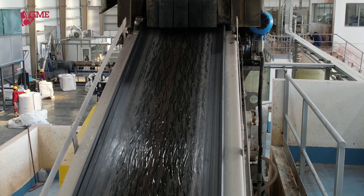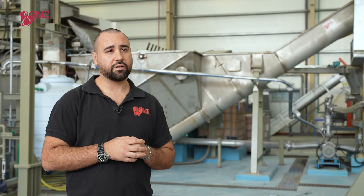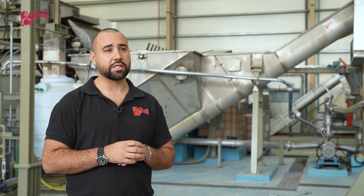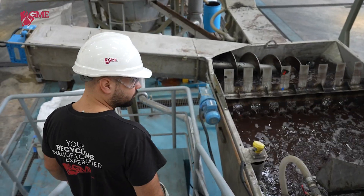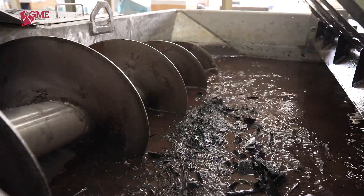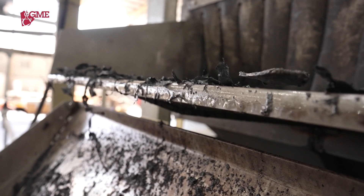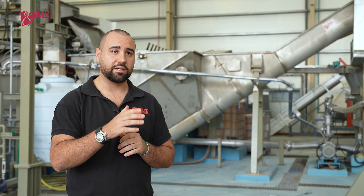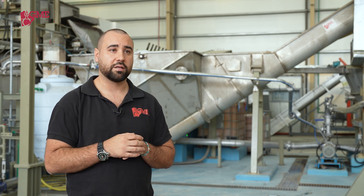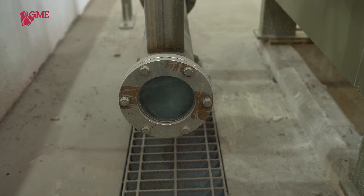The T-shaped hammer also achieves twice the lifespan of the previous one. Another very important feature is the vibrating hydro screen — composed of a screen washed by high-pressure jets — that guarantees the separation of lead paste, which is collected in a tank, from under-screen materials such as plastics, separators, and others. This high pressure guarantees a perfect washing system, simplifying the next steps.